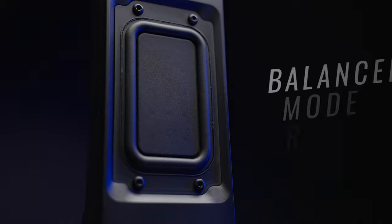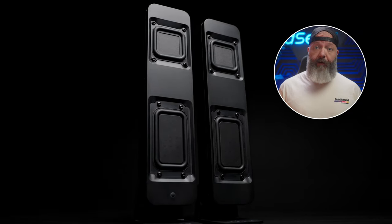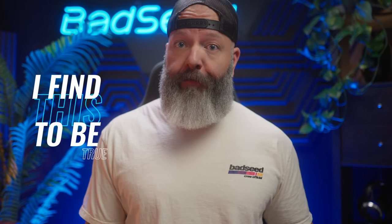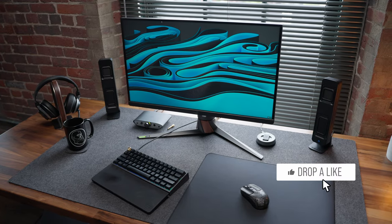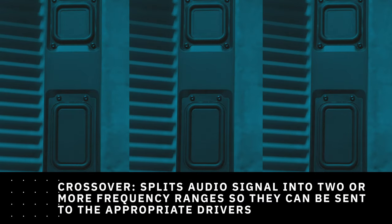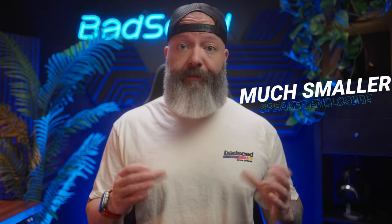The BMR in the name is for balanced mode radiators, so they're not using the traditional cone-shaped diaphragms that we see in most loudspeaker designs. They make a lot of claims about this driver design — there's a lot of technical info I'll link in the description if you want to know more. The big stuff you need to know: they offer wide dispersion, so you don't need the speakers pointed directly at you, and they claim this does a better job of filling the room with sound or handling multiple listeners. I find this to be true. They have increased dimensionality and sound staging that helps create a wider, more immersive sound because they don't need a crossover — that's a component that directs certain frequencies to the tweeter and to the woofer — because these are single driver. I found this to be true as well.